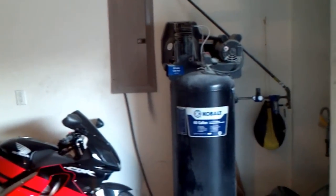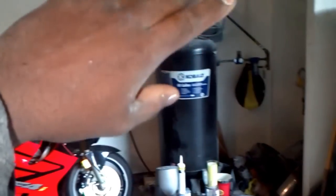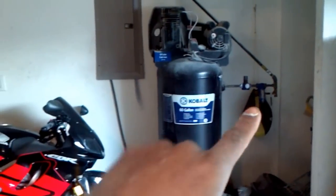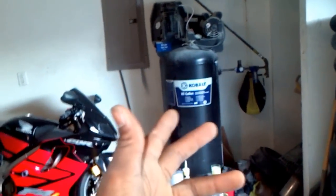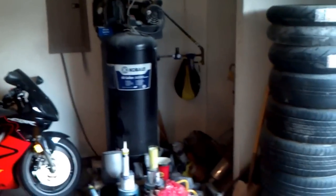But just remember that your water has to drain down from where you are. So if it's going up, you want it to drain down, right? Because I'm sorry, I never did explain this. What you want to do, when you go way up, is get the air to cool down. Once it cools down, then it's good air. If it's coming out of that compressor hot, let's say you were doing everything directly from the compressor, you can get a lot of water in your system because the air is hot.